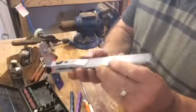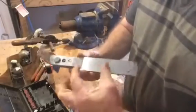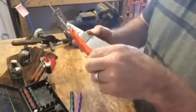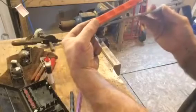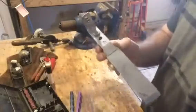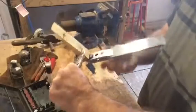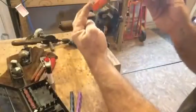Okay, here we go. We've got the iron installed into the little vise that comes with the kit. Now typically when you have a knife in here, the edge of the blade is way down here, and it shows you little graduations of the different angles and you pick the appropriate one. But the iron is so long that I don't catch that angle properly on the bevel there. So all I've done is taken a little wedge, put it on here, and just clamp it in place. I preset that hole — I've used this plenty of times — and now the angle is looking pretty good.